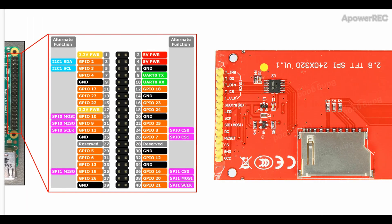We have our Raspberry Pi GPIO pins on the left and the SPI screen on the right. We are only going to worry about the 9 pins from the bottom and not the top pins for touch screen control. Starting from the bottom, we have the VCC which is the 3.3 volt input - we are going to connect that to pin number 1 which provides 3.3V power. The ground goes into pin number 20.